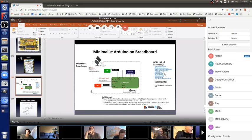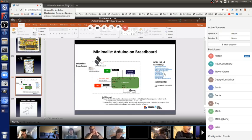Yeah, good. So here is a red LED, and I have the plus side marked, and then a resistor. That's actually a 1K resistor. And here's the chip. It's actually ATmega328P. This resistor and LED is the what's called built-in LED. That's the one on pin 13.